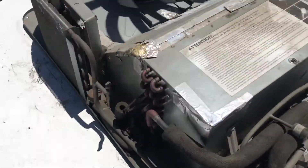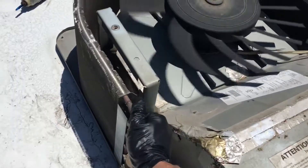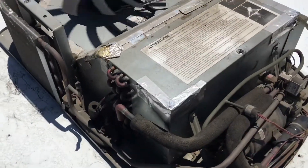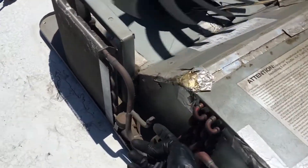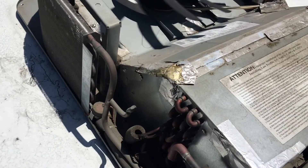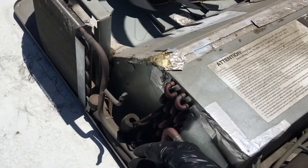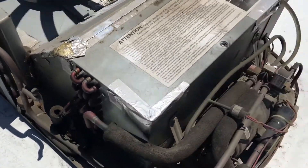Okay, you can turn it off. We don't have the fan, so I can't force air through there to get it down, but I know it's operating — so that's a good thing. I'll cut this off first, put a tap on it, suck out the refrigerant and recover it, cut it off, braze on a fitting, do an evacuate and recharge, and it should be good to go.